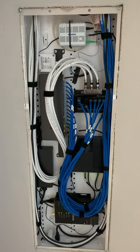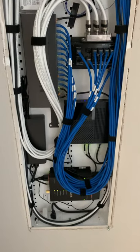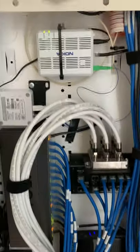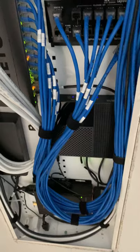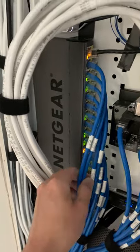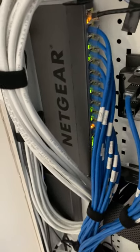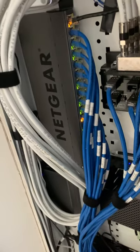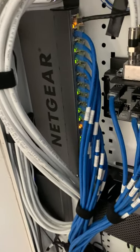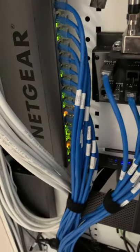I just want to go through exactly what we have going on in here. This is similar to most structure cans that we wire up or most systems that we provide. In this case, we have our fiber coming in from Cox Cable that connects to our Ruckus router down here, and we have our Ruckus router feeding our 16-port Netgear PoE switch. We ran all these wires in the home, so all the TV locations are pre-wired with Cat 6, so those TVs — or whatever is behind the TV — aren't relying on a Wi-Fi connection; they're actually getting a more reliable hardline connection to the network.